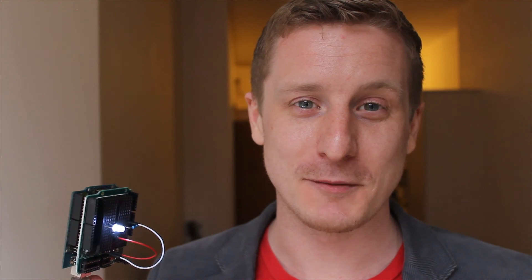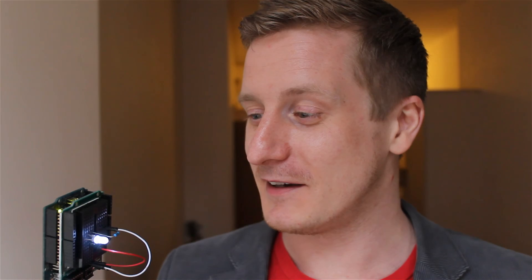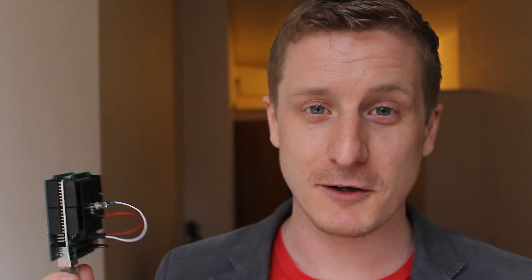It's up to you whether it's worth six pounds or whether you'd rather get a dedicated ISP or homebrew something on a breadboard. But this is actually really useful and I would recommend it to beginners who are just starting out with the ATtiny, or people who just like the convenience of using the Uno as a platform that gives you steady voltage and two voltage options without needing a regulator when prototyping. And it's not just for ATtiny stuff — you can use the prototyping area with whatever board you've got underneath, whether it's a Mega, Uno, Leonardo, or whatever. So I think it's cool — you should check it out. Thanks guys.